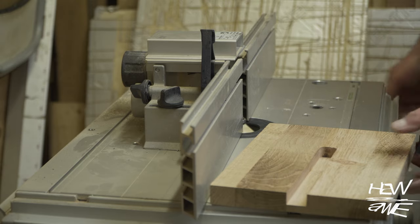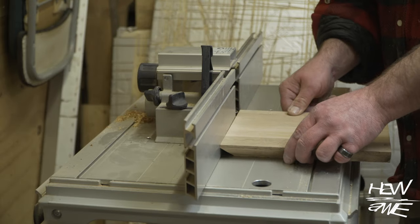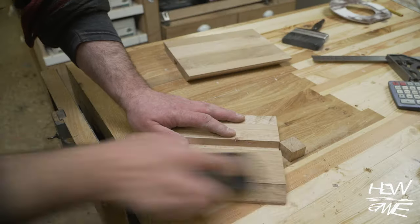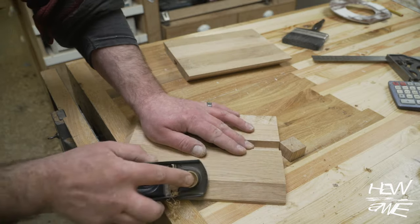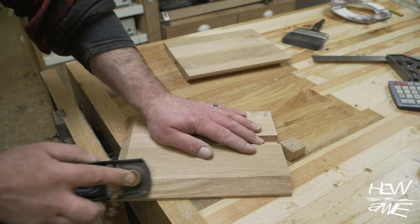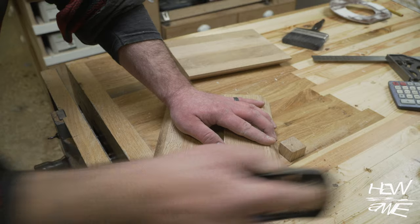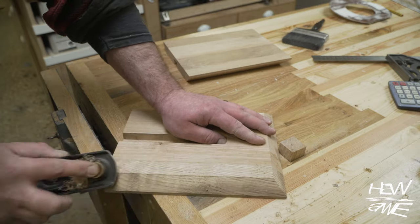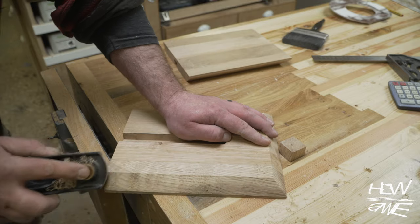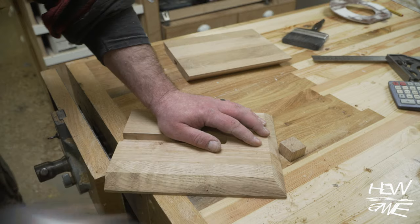Same deal for the lid, and a nice little chamfer. The chamfer bit I was using wasn't quite big enough, so that left me with some cleaning up to do to extend that chamfer. I wanted a nice 5mm right-angle lip on the top, which was important because I wanted that base to disappear into the base of the speakers, so the speaker looked as one unit. And then the speaker stand itself just looked beautiful.